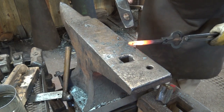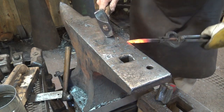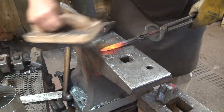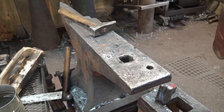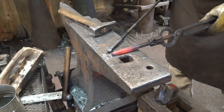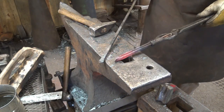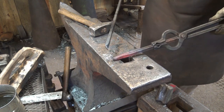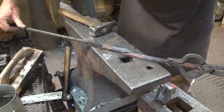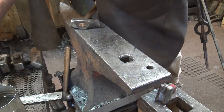I'm preparing a scarf - go back and watch the video on scarves and scarf welding. The twist doesn't require this, but I've also prepared a scarf on a piece of 3/8 square bar and I'm going to weld these together to give me a handle, making the basket twist a handle for a fire poker. This is what's called a drop-the-tongs weld, and it's worth rehearsing the motion before you get to welding heat.